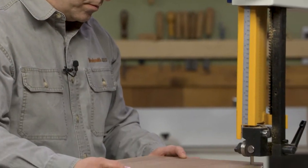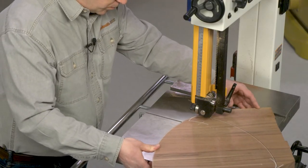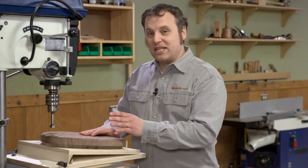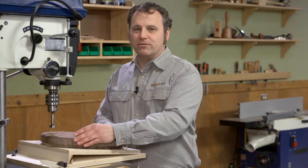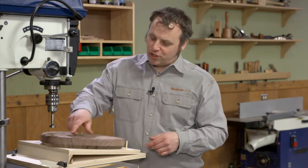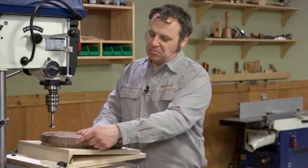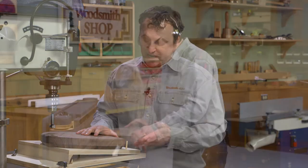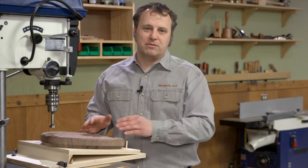At this point we can take the blank over to the band saw and cut it to shape. When standing at the band saw, you want to do so in a smooth, fluid motion. A lot of starting and stopping is just going to create a rough edge that's going to be a lot harder to get smooth later on. The band saw is inevitably going to leave some blade marks along this edge. I used an edge sander to clean up those edges and round the corners, but you could use a palm sander or even just a long piece of sandpaper on a flexible block.